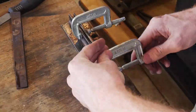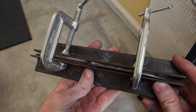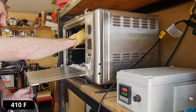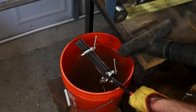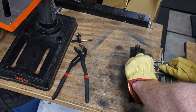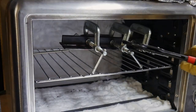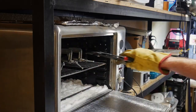I clamped the blade straight and put it in the tempering oven at 210 degrees Celsius for two two-hour cycles. In between cycles I cool the blades to room temperature, re-tighten the clamps to make sure everything is nice and tight between the two pieces of angle iron, then get it back into the tempering oven to complete the second cycle.